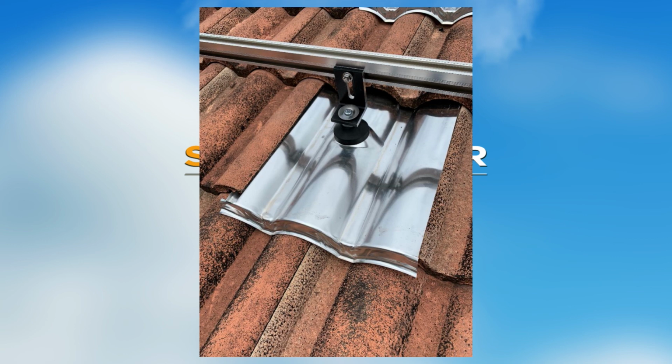So that's a W tile, fits right on the roof. You've got the little rubber boot on the shaft that goes up through there, and on top of that, you've got the L-foot bolted in, and the rail bolted onto that. And on that picture, you can barely see it, but above that is another tile replacement, and that's the beginning of the next row of the rail, so it goes right up through there. A beautiful visual example, I should say.